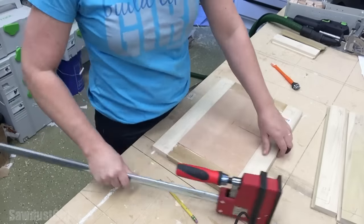Now I need to dry fit these to make sure they fit perfectly within my cabinet openings. But I don't want my eyes to be tricked by the variation in color, so I'm going to prime these drawer fronts so that when I install them, everything's the same color and I can focus simply on sizing and spacing. As soon as these dry, that's exactly what I'm going to do.